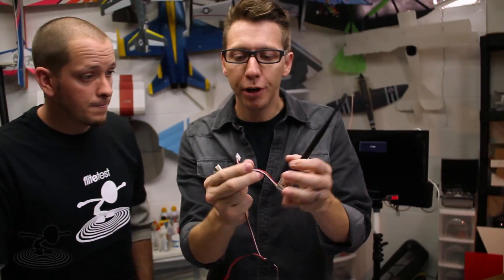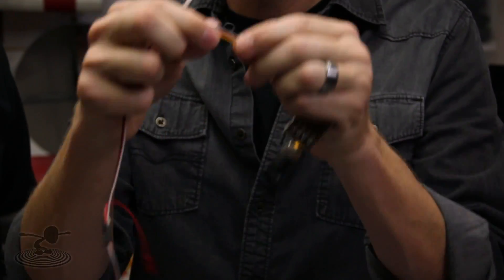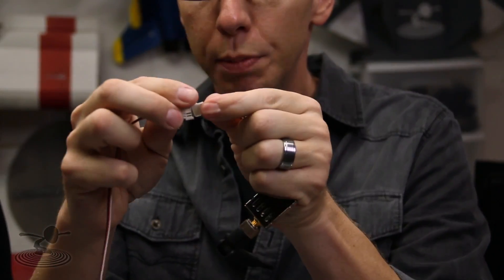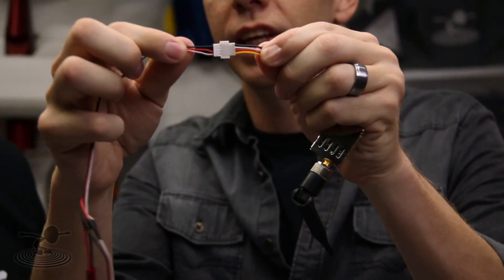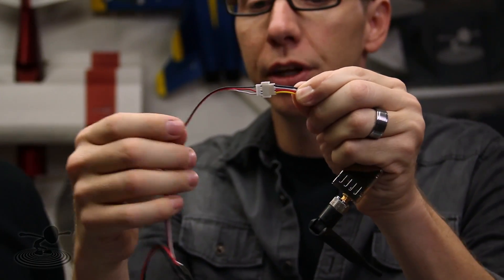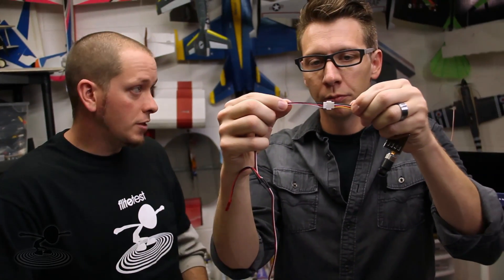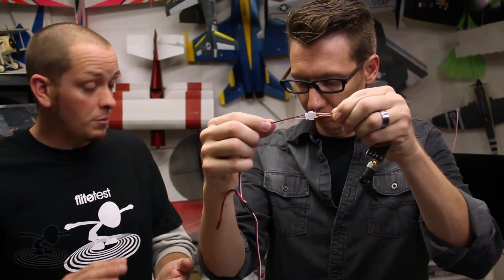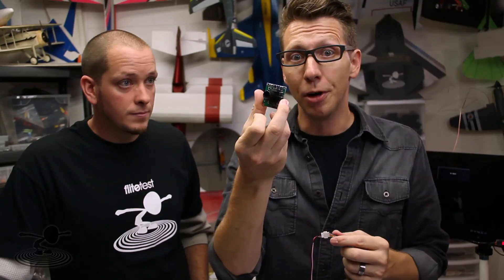On your transmitter, the yellow is the video. So when we plug in this wire harness, you'll see the white actually goes to the yellow, because they don't have a yellow wire on this harness — that might be a little confusing, but just trust us. The best way to follow it is to look at your video transmitter, because video transmitters almost always do sound as well. Find the yellow and trace the yellow back. Now, all these wires don't do you any good unless you have a camera.